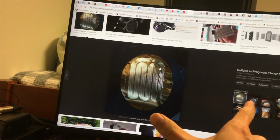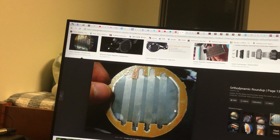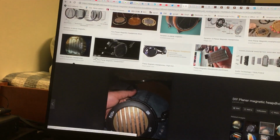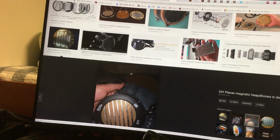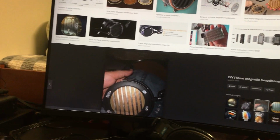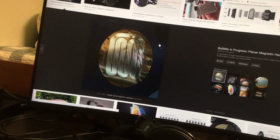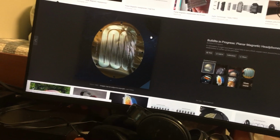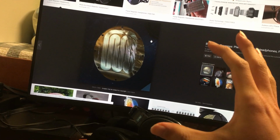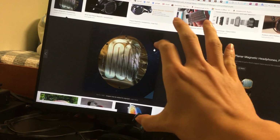You need to actually stretch it and make it very rigid, as opposed to soft or elastic, because you want lower distortion in the treble region, like frequencies above 10K. So it needs to apply some tension. But what tension would do to the driver is that it would lose excursion, because imagine this: if you tension the driver really tight, then it can't move back and forth for a long distance before it has to stop.